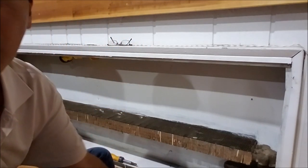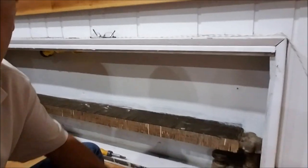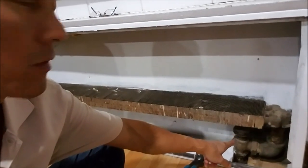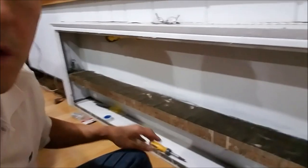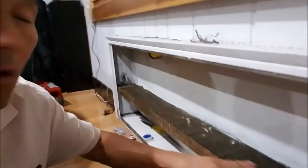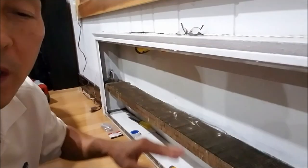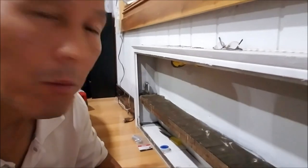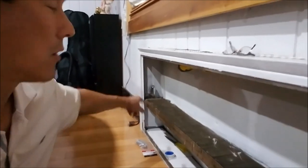Okay. After you turn off the main shut off valve here, no more steam spits out, but the whole radiator is still hot. So you've got to wait for at least about 10 minutes. After about 10 minutes you can remove the vent valve.